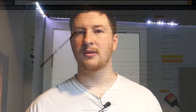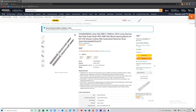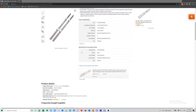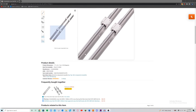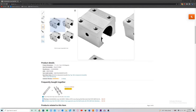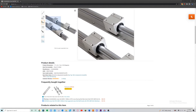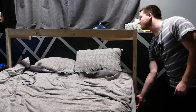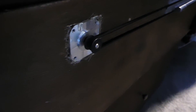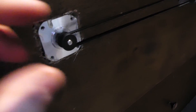To fix all these issues, I came up with one idea: let's just buy our way out of it — but not with those expensive sliders. So what I decided to do was use linear rails with more of a cylindrical slider. Though it's a little bit wider, they're really long and I can get two for a really cheap price, and they both came with the actual slider parts. I stuck these on the side of the bed and they slide really well. I also drove the Y-axis by sticking two stepper motors into the bed attached to the sliders to pull it back and forth.